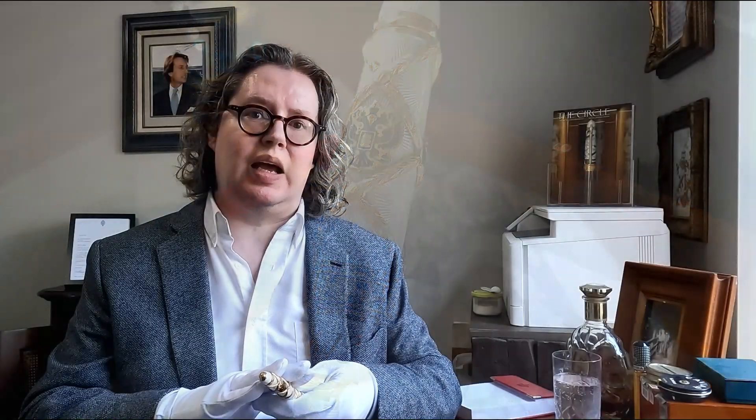After firing, the hard enamel is ground by hand with a diamond file, after which another layer of hard enamel is applied to the pen, in order to build up the layers of opaque and translucent hard enamel. This process is repeated 20 times and produces a depth and a richness that is unique to David Oscarson's creations.